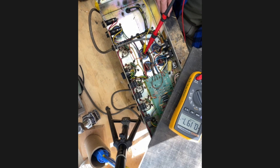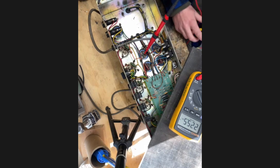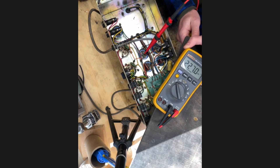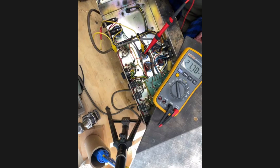For safety, it's a good habit to always connect your resistor — you can see how that voltage just went straight to ground. The other end is connected to the chassis. Let me do it again: I'll turn the amplifier back on so you'll see the high voltage — about 230 volts — and then when you connect the discharge stick the voltage drops very quickly.